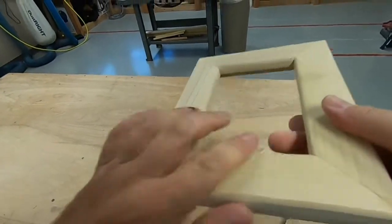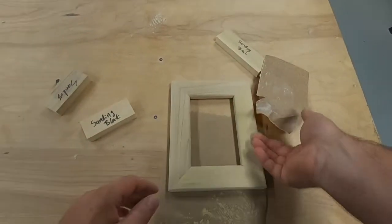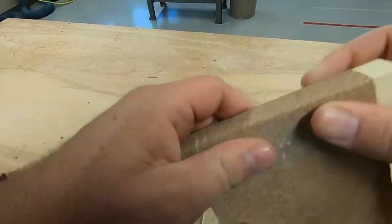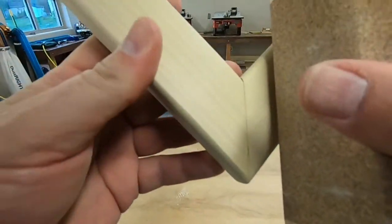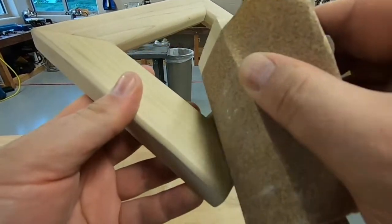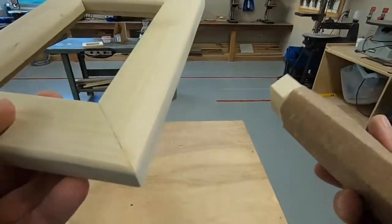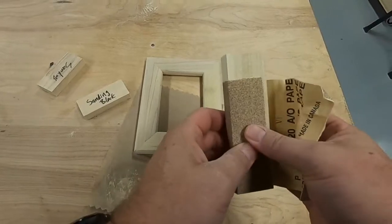When we do these corners you've got to be really careful. We're going to keep it flat on the table and take the sanding block — wrap your paper around that so you have a definite edge. What we want to do is take that edge and match the angle that's on your wood. We're going to go right up to that angle this way, then change directions and go right up to the angle this way, so we get all the filler out without cross-sanding the grain pattern.